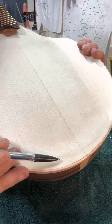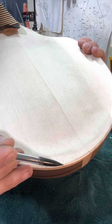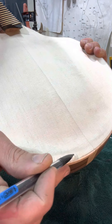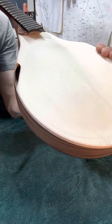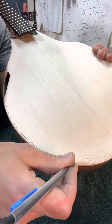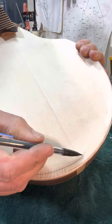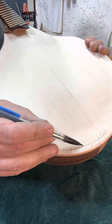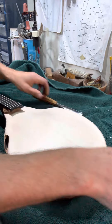I'm going to be carving this ledge to be a little bit more of a gradual natural flow up towards the sound port. I like things that flow nicely, so I might do it like that and kind of fade it out underneath the tailpiece area. You can see there's a good bit of material I need to bring up and then kind of taper that lip.